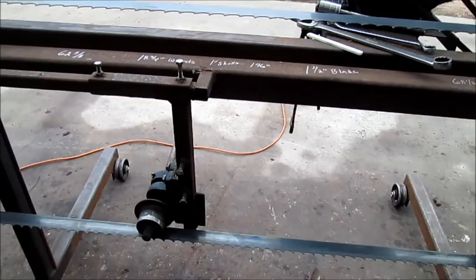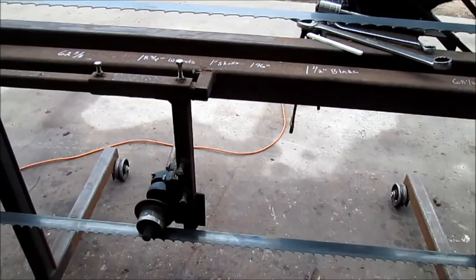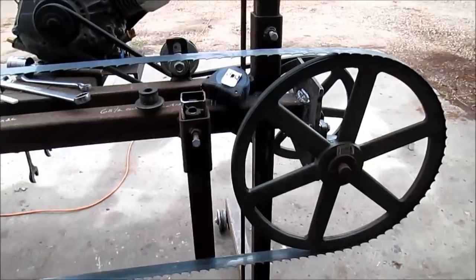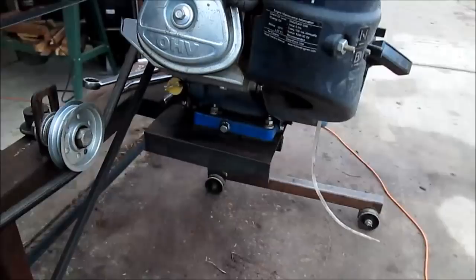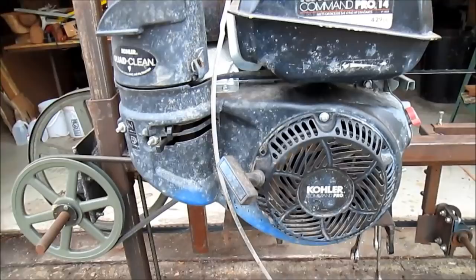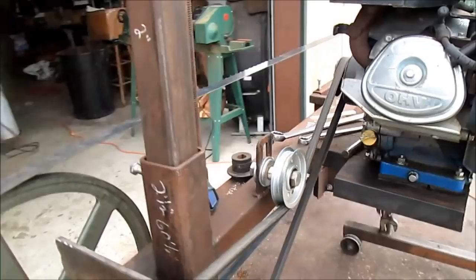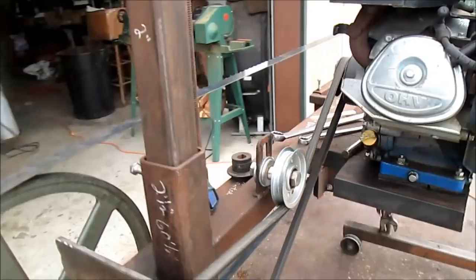I'm not sure I've covered everything you need in this video. Again, I apologize for the background noise — I really don't have a good location to shoot these videos, especially with a sawmill like this, and I'm not going to put it out there in the dirt and mud. I'm going to run around back and get you a shot of the motor. We're running a little Kohler Command Pro 14, 429cc engine. It seems to do a very good job — it never loads up. I run it at about three quarters throttle. It's an old motor I've had about three years, previously run on a water wheel drilling machine I built about four years ago. I'm running a little centrifugal clutch on it — this is the original clutch and I've been running it for the whole year with no problems. It must be a pretty sturdy little clutch.